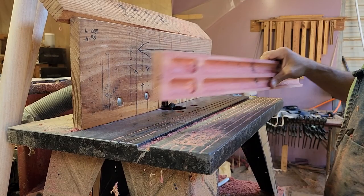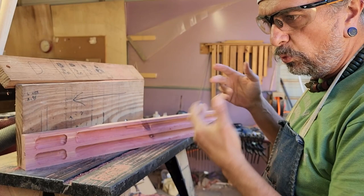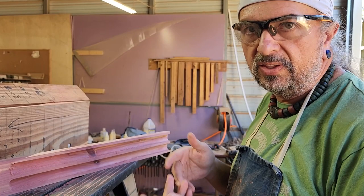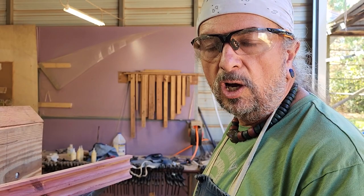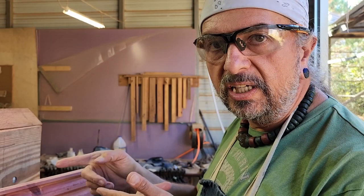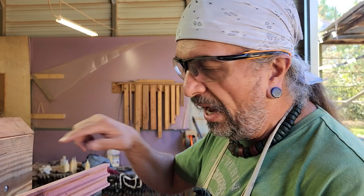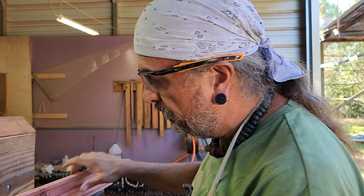Oh, also, one thing I didn't mention. In making the size of the inside roughly an inch, once again, I'm not using a one-inch router bit. That is actually more dangerous than using this three-quarters inch router bit. It's just part of the deal. Everybody thinks, I want this size router bit and that size router bit. I've had a lot of woodworkers ask me, where can I get a 1.5 inch core box router bit? You don't need one. The smaller one actually cuts faster, cleaner. I can replace it at my local Ace Hardware, Lowe's, Home Depot, True Value, whatever you've got. It is a lot cleaner cut. It really is. All you have to do is a little bit of math to figure out how you're going to wobble that 3/4 of an inch to make a 1 inch out of it. It's not really that difficult. Anyway, here we go.